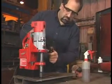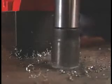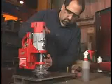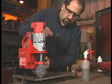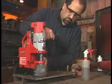Start the motor with the ejector pin and cutter above the work. Proper technique requires some practice — the key is to apply firm, constant pressure. If you're not applying enough force, the chips will be small and broken, which increases drill time. If the motor is laboring, you're applying too much pressure, which slows drilling speed and can damage the cutters. This is the way it should be: firm, constant force, with chips forming a bird's nest — that tells you the feed rate is correct. Never peck-drill; keep constant pressure through the entire operation to prevent chips and burrs from falling under the cutter. Debris under the cutter can make your job difficult or impossible.